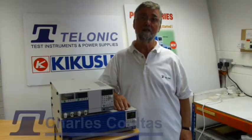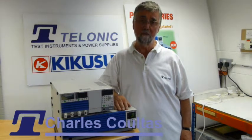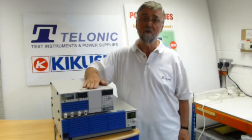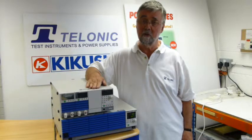Hello, I'm Charles, an engineer at Talonic Instruments. Inrush current measurement is very important. If you manufacture equipment, or resell equipment, or specify equipment, you need to specify what the initial hit of current is when the unit is first turned on the mains.